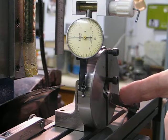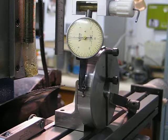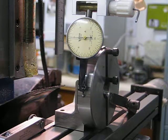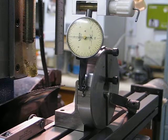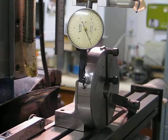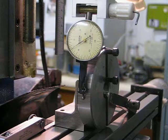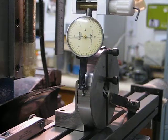I've lined up the center of this round faceplate almost by eye, in the center of the spindle. It's just placed there — I haven't clamped it down. Now, as I wind the dial indicator up it drops off, and as I wind it down it reaches zero and then starts to drop down again. When you find that point where the changeover takes place, that is basically the center.